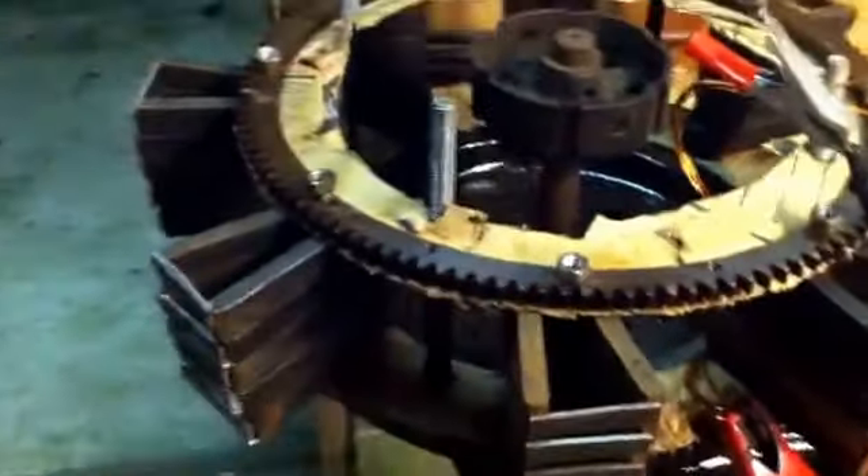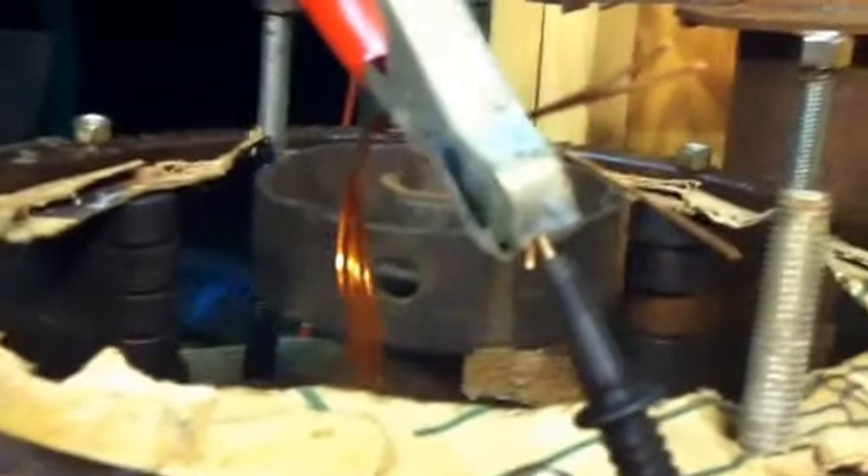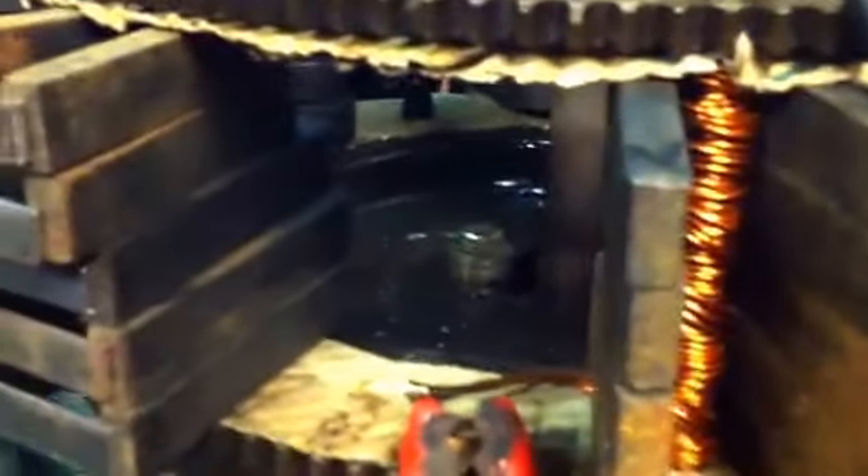What I did here is just one coil, based on a simple test from the last video. I have about 16 gauge magnetic copper wire — I took about 16 feet, folded one end to the other end, then folded it again, then cut it. So basically I have four strands.